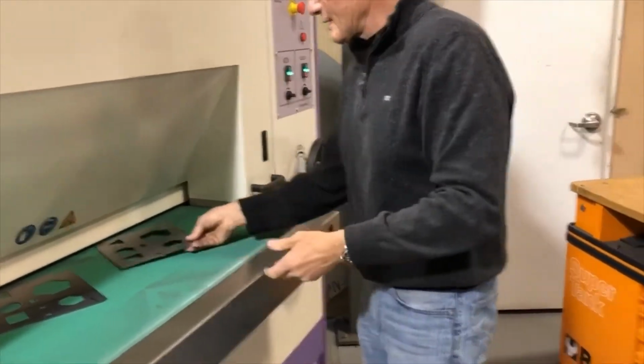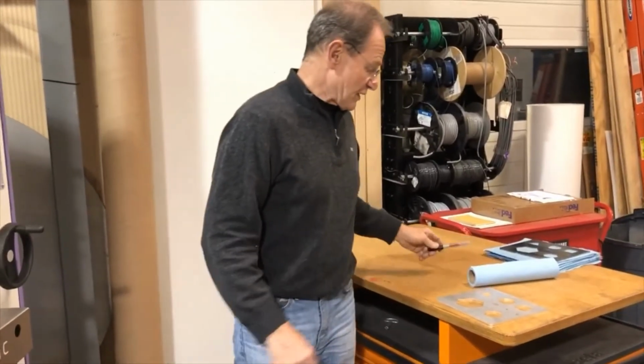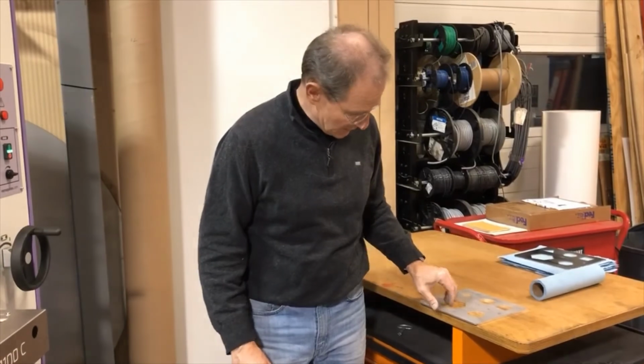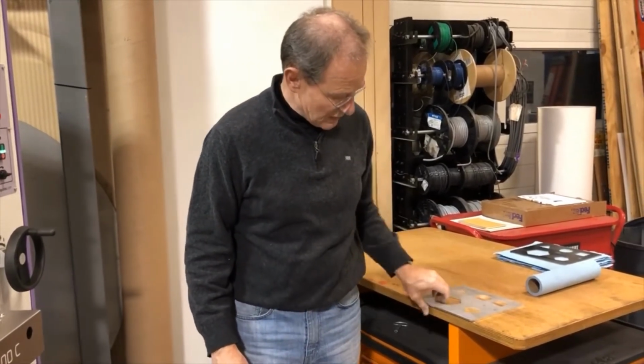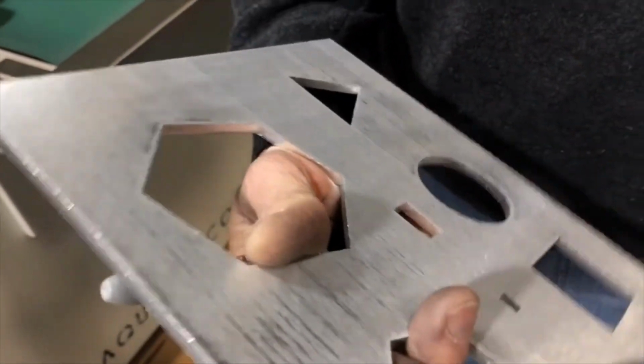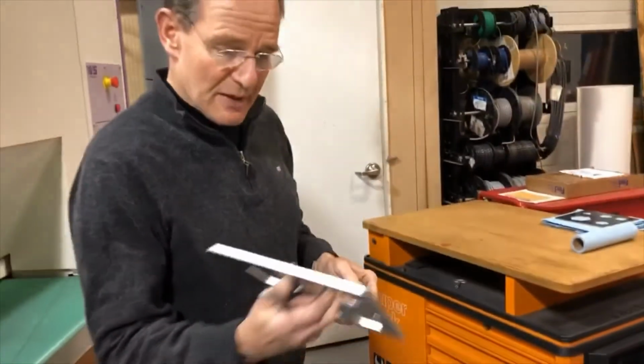Set up for this. We run the top side of this. That's 2 feet a minute. Then the aluminum we're going to run at about 4 feet a minute now that we have the dross removed. You still can see here on the side you have the side serration from that dross, but that's the edge round.